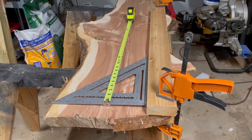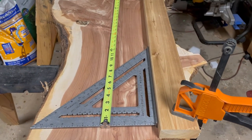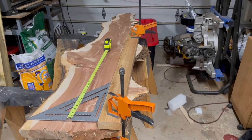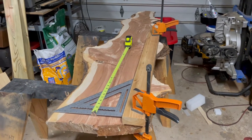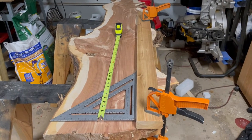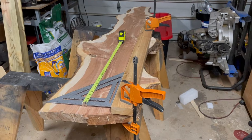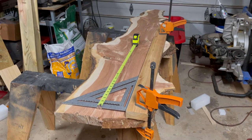I'll bring you back from time to time — I've got my little tripod out here so I'll film some of it. Right now I'm just marking it and getting it set up to cut. I'm gonna take my time so it's done right. I'll probably go get a quart or so of that two-part epoxy to cover this top. It provides better protection, but you can't get in a big hurry when it's setting up — it really takes a week or so to cure to the point where you can put something on top without leaving indentations. I learned that from our nightstand.